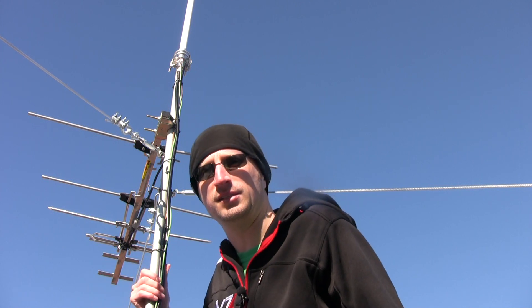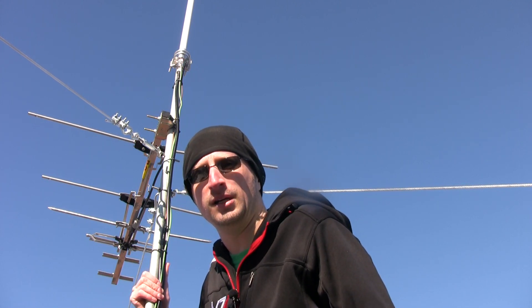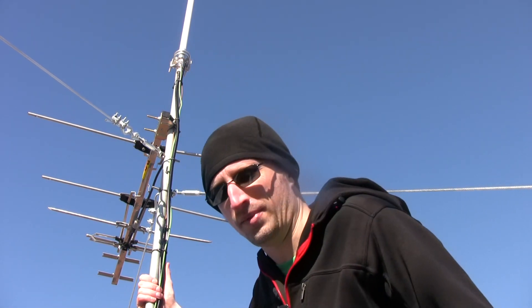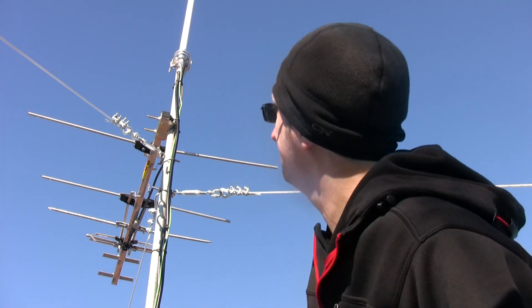The results have been pretty good — I've gotten anywhere from 1 kilometer nearby to 35 kilometers to the north, which is the direction the Yagi is pointing. The setup is about 30 to 45 feet in the air. To my right there's a small forest, but it's still getting good results through there. It is still winter with no leaves on the trees — I'm not sure what will happen once leaves come out, as they will dissipate the signal since it's all line of sight.